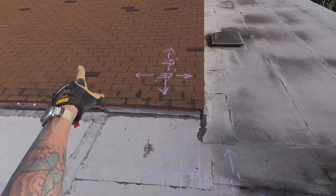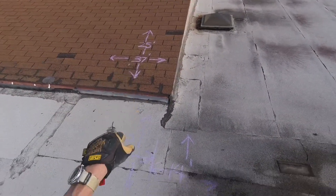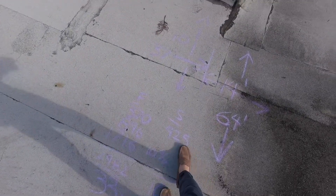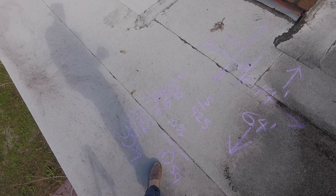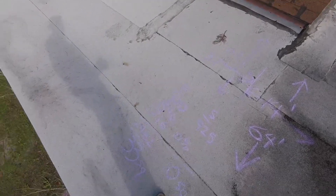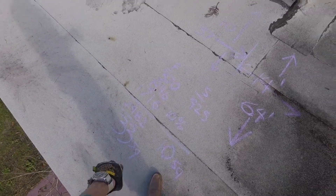For the shingle section, it's 25 by 37 — that's 925 square feet. Add 10%, and you come up with exactly 1,000 square feet, or 10 squares. So these two are your magic numbers that I'm going to build your estimate with.